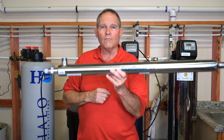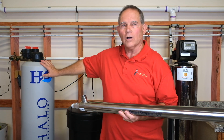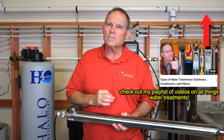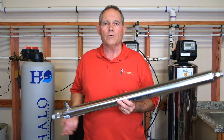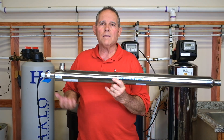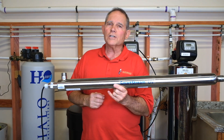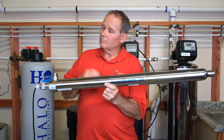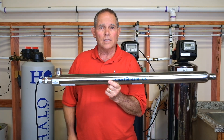This is the top tier of water filtration. I don't recommend having these without a water filtration system — either a Halo 5, an ultimate-type system, or a water softener. Remember, a water softener does not have filtration capabilities — it only removes the hard water minerals, calcium and magnesium. The Halo 5 in conjunction with a water softener is what we call our super soft combo. I'm not sponsored by Halo — it's just the one we install and it's a very good system. UV lights are totally separate from the filtration system, but you want filtered water if you're going this far, to also remove heavy metals, pesticides, and contaminants beyond organic pathogens.